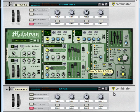To do that, we go like that and make sure that this toggle isn't set, and switch them to bandpass. We're going to use the spread knob here, and that's going to spread the outputs of the filters to opposite sides. I want to use it so that I can hear the filters on each ear, making it easier to hear exactly what each filter is doing.